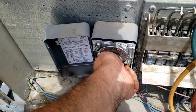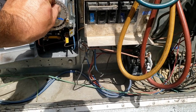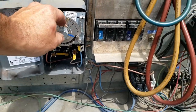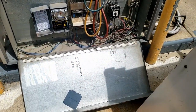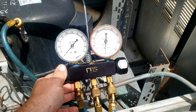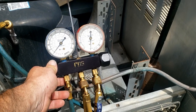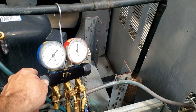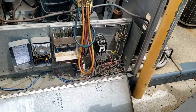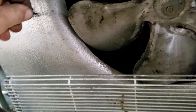The defrost limit was happy, so we're going to have to reset it. Maybe it just timed out. I think I'm going to set that down to 32 minutes - it's got termination so I'm not as worried. It's pumping down. It's a little on the low side but we can tweak that here in a little bit. It's staying engaged, so we're going to finish melting that out and cleaning this muck off the fan blades - it's kind of ridiculous.